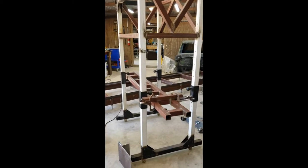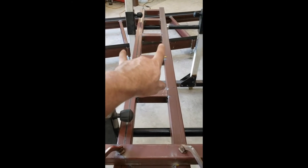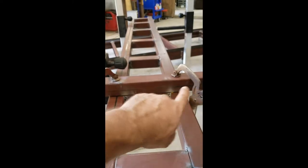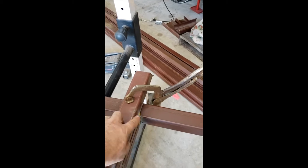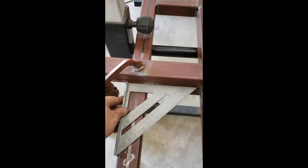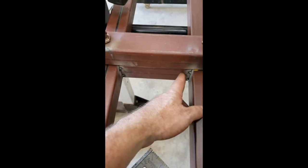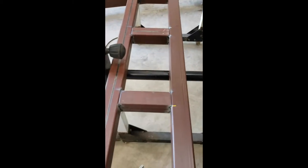We're back on the cradle and the cutting head. I've gone ahead and tack-welded in these spacers — I've got about six-inch clearance across the center. I'll show you a little jig: I've just got this scrap piece of two-inch, and you take your measurement for how far you want it across, put one side on, clamp it down, and then use a speed square to make sure it's square. Then slap the bottom piece up in there, keep it flush, and you don't have to worry about keeping it square while welding. When you're done, just pop this piece off and everything's nice and square, no problems.